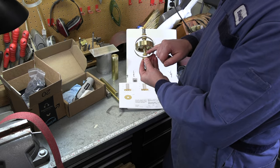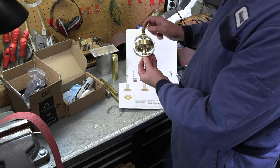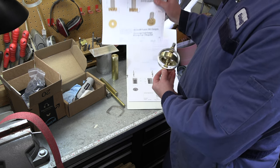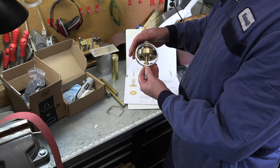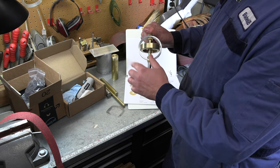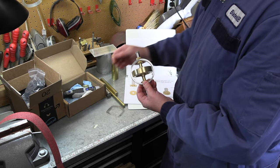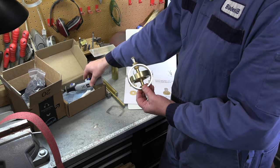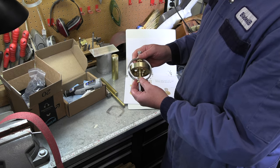So just like I have these spacers riding on the top inner race of that bearing, right now that inner race of the bearing is riding on the back side of this bearing cup, creating all that friction. So it feels good when you just spin it here, doesn't feel bad. I tried running this up with compressed air, and I can't even get near the speed with compressed air that I can get with this one. And even when I crank it up with this motor, this thing only runs for a minute, maybe not even a minute. It is slowing down way too fast.